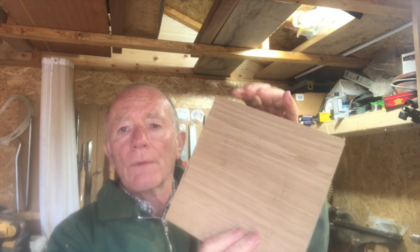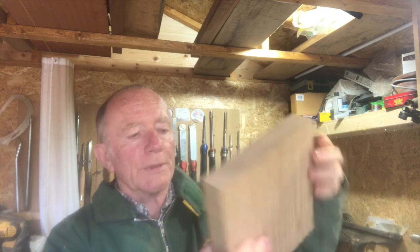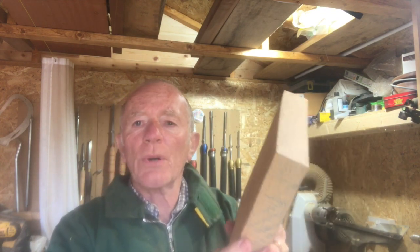Without any further ado, let's get on. I'm going to glue a chuck and point onto these. Obviously find the centre, glue a chuck and point onto it, and then take that down to approximately 6 inches, and then I'll build all the rings up. I'm not going to bore you with making ring after ring, so I'll show you in detail how I make one ring, and then once they're all made, how I glue them all together and fit in the lid. Let's get into the lathe.